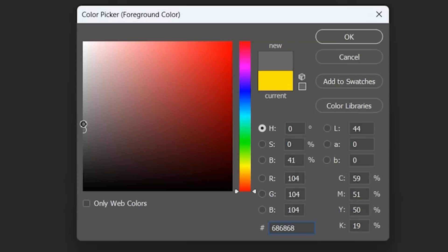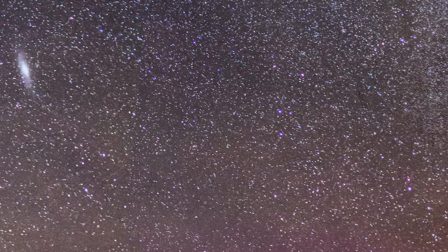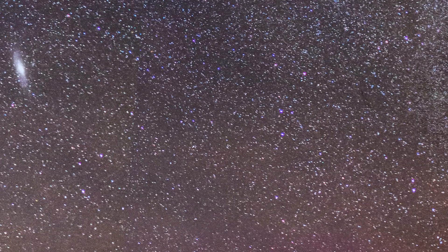And if it reaches the maximum charge that that photosite can handle, then it assigns a number like 255, and that tells a computer that that pixel is pure white. So for stars to be clear in an image, you want a high enough charge being generated by that particular photosite that it creates a clear bright spot in the image, rather than something that's just barely above dark grey and looks like a smudge.